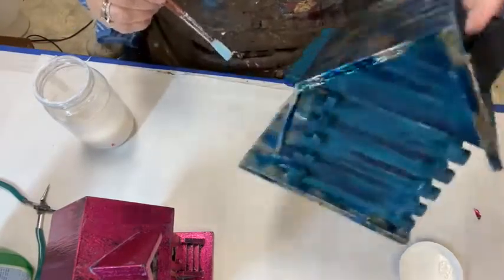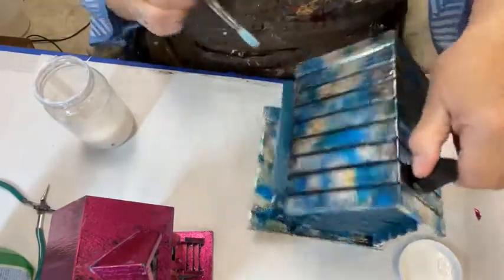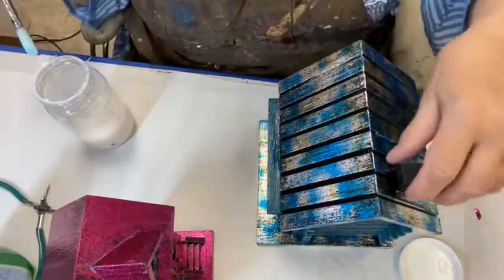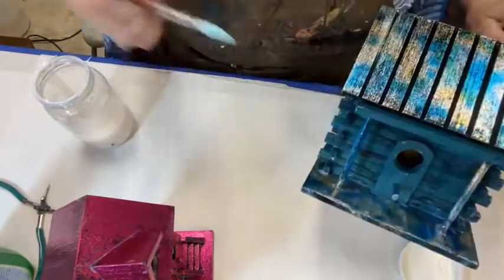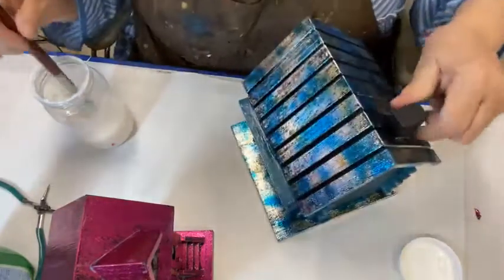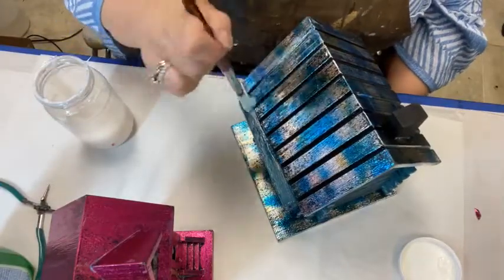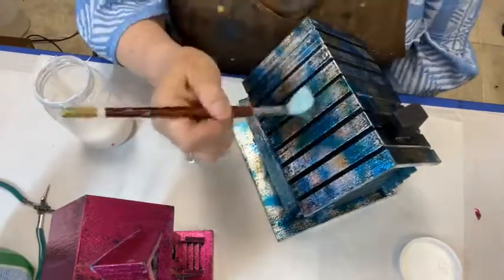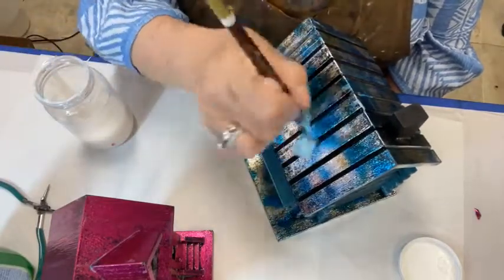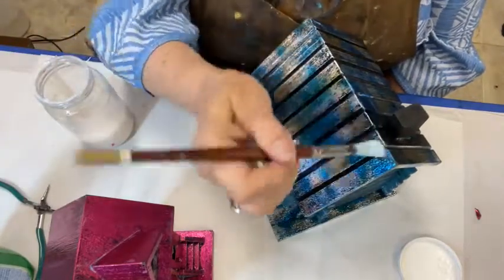Reminder: our Saman water-based stains are not exterior rated. So if I wanted to put this outside, which I'm planning for right now, I need to use a water-based exterior-rated top coat. If I wanted to protect my colors better, I'd use a UV-protectant top coat, which I don't have here right now. I'll determine where I'm going to put this and whether I need the UV top coat on it.